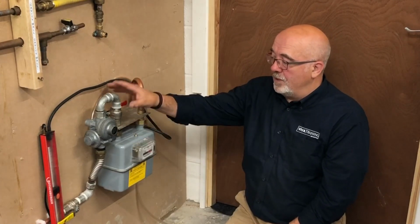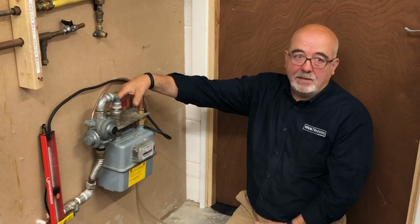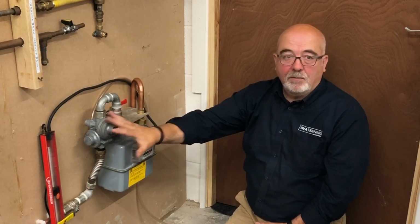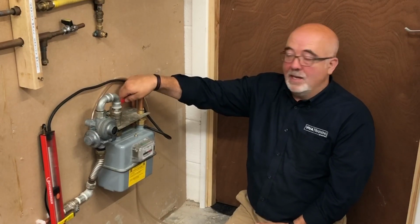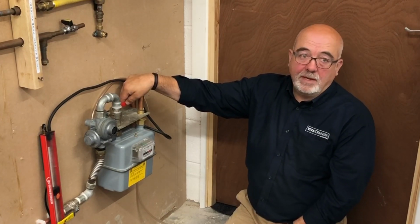Which valve should a customer use to turn the gas off? As long as it's got the additional valve here, always advise them to use that valve, because that way they don't need to worry about that inlet and the resetting of the medium pressure regulators. That is off, on and off in a conventional way. That's effectively your meter emergency control valve.